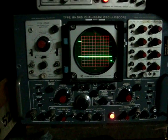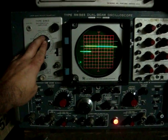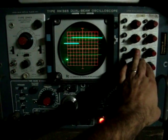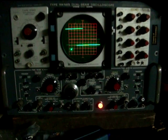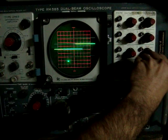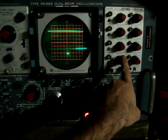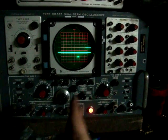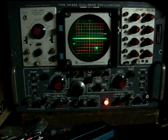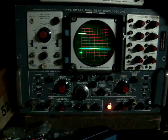I love the scope to death, but it's not very high frequency — only about one megahertz for the main frame. This amplifier is really slow, 300 kilohertz. This one needs a little bit of work too; it can't go very negative. Something is a little amiss with the vertical drive. Unfortunately, the 500 series plugins have a vertical amplifier in them, which seems to me to be a kind of expensive way to do a plugin. The later plugins are a little nicer in that regard.